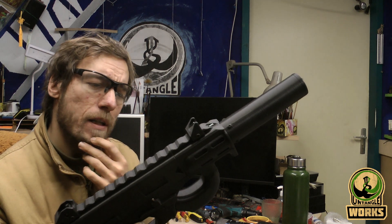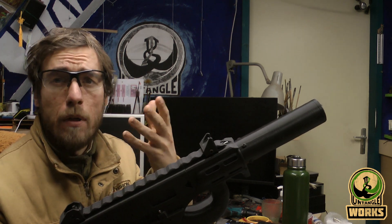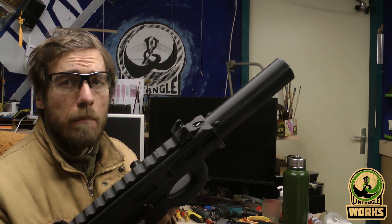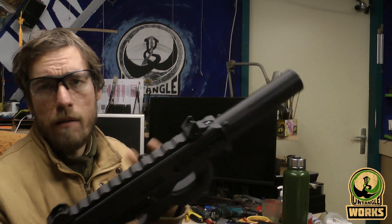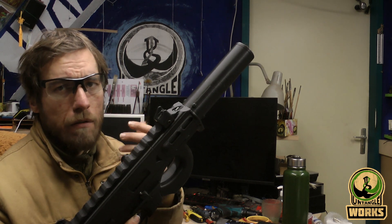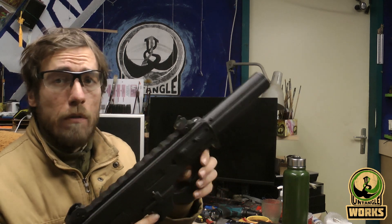The only thing I can consider going on is the output valve is pressed against the fitting, and that might be pushed away in a moment when I want to put some pressure on it. That might be something I can fix later, but the way I want to do it right now is that it is easily removable in case you need to service the output valve. You might conclude that you want to glue or weld it permanently so you don't have to worry that it separates over time. But we will see.